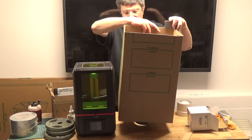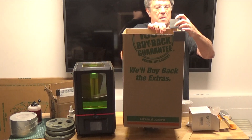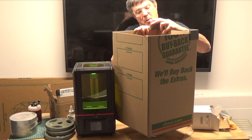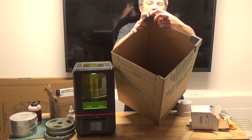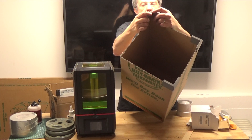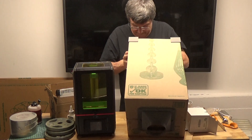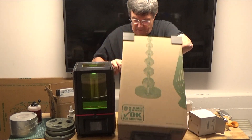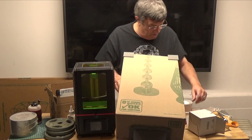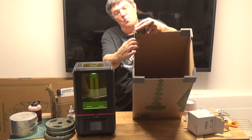The next thing is the bottom of the box. There are four feet that you'll need to print so that the box is lifted slightly above the table or surface it rests on. That serves two purposes: it allows the air being sucked up to find a passage and not create a vacuum inside the box, and it also gives you enough clearance to run the power cord out from the printer to the wall outlet. Because we're sucking the air in, the fumes you're trying to avoid are not going to get out and contaminate things.